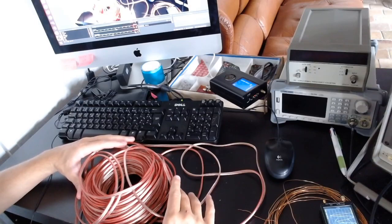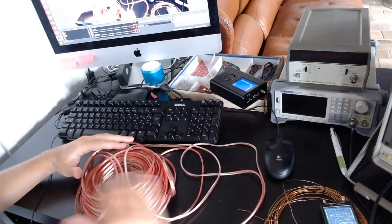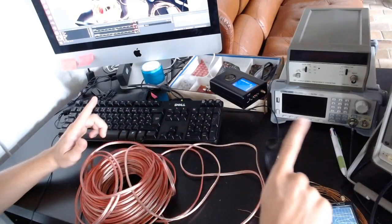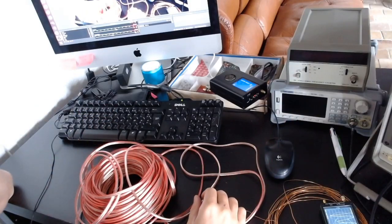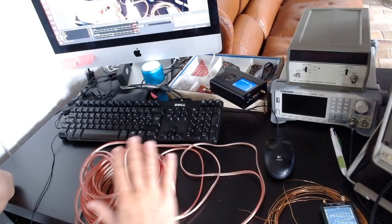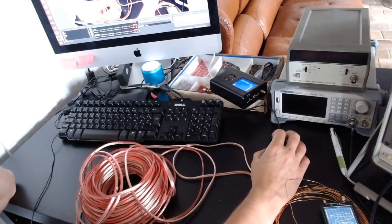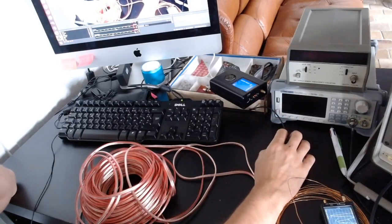This system is basically a half-wave end-fed wire setup. Unfortunately, I simply don't have enough space — the length of my windows where I can put the antenna horizontally outside is just seven meters, whereas a half-wave for 20 meters would be 10 meters. So this setup is too short, but it's what I can do practically, and it still works pretty well thanks to the antenna tuner.